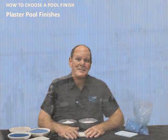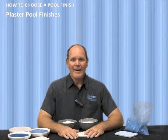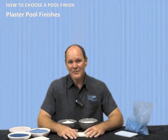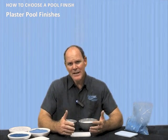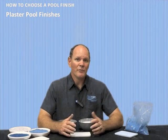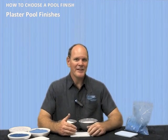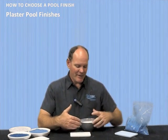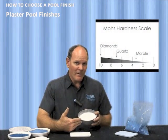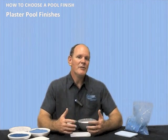And plaster, it's an oldie but a goodie. It's been around for a long time. It's smooth, it's affordable, and you can do all kinds of fun things with it, but it does present some challenges. If you remember in the intro video, I mentioned that all pool finishes are going to be underwater, obviously, and water is very harsh to pool finishes, particularly to the cement. What kind of gives a double jeopardy situation with plaster is that the marble sand itself is very soft as well. So you put those two ingredients together and it just becomes a challenge to maintain the beauty and the look and the appearance of the plaster finish.